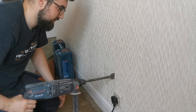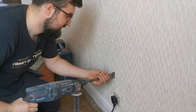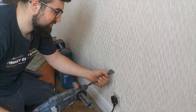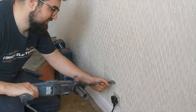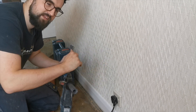When we chop this out, we're going to go 5mm past and chase into the wall about 25mm depth. I'm going to angle it slightly outwards on both the bottom and top cuts. Then we'll come in from the side and take big chunks out, which will bring it back to that 25mm depth — it'll be quite lumpy at that stage.